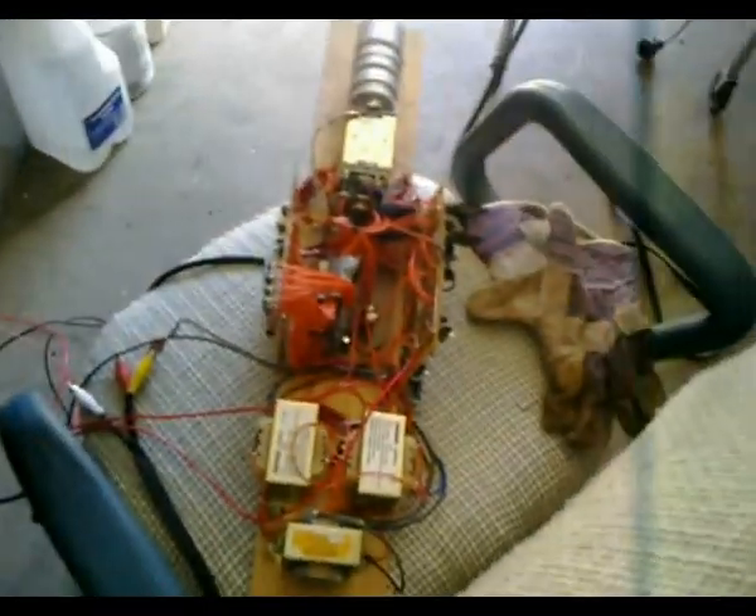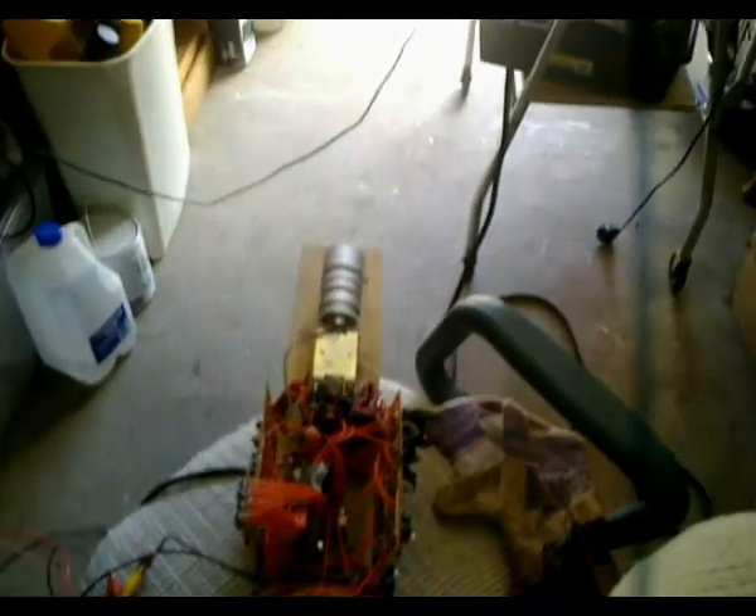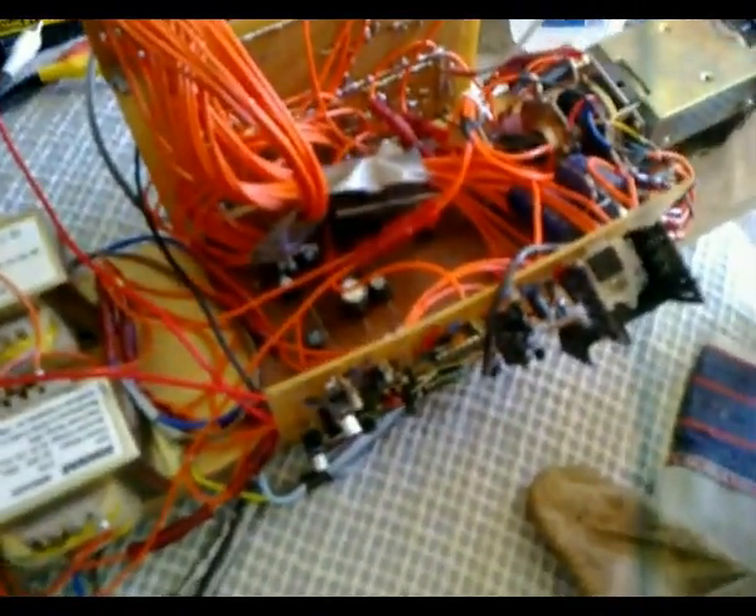I've been testing it out and it looks like it's working quite well. With this camera I've been having problems getting a good vertical sync to record to videotape or to my DVD recorder, but after connecting the horizontal and vertical syncs to the external horizontal and vertical sync inputs to my time-based board it solved all problems. Surprisingly though, I didn't need to use an IRF return lead to its IRF port — as a matter of fact it actually shuts the picture down for some reason.